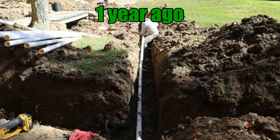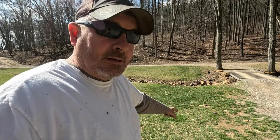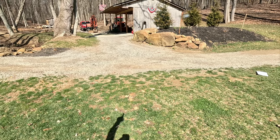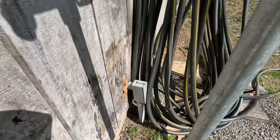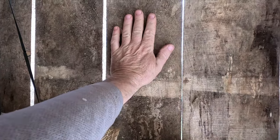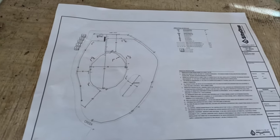I've got my two-inch main across the creek right here with a meter pit set up. From that meter pit we go underground — there's a conduit chased over there for wiring, and a conduit coming up. We'll build a mount right here for our irrigation control panel.